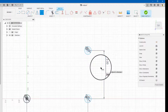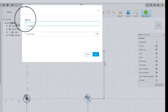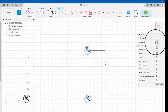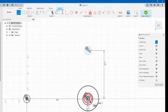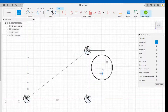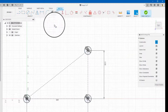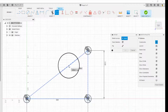The next step is doing the members. I'll hit save at this point — let's go truss one. To do the members, I like to draw them in first with lines as construction lines. So I go here and then I can go center to center, up there, and back down. Now there are two ways you could do this. You can offset each line. I'm going to turn off construction and go to offset. When I pick this, notice the whole triangle appears, because I basically drew that as one continuous construction line.